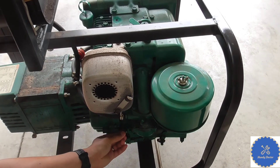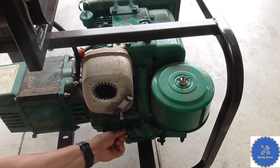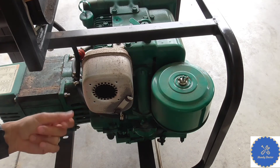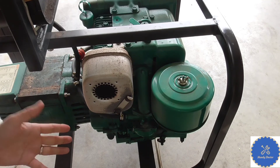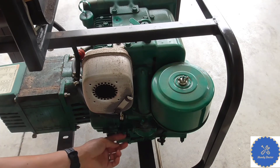So you see the screw out here — you can actually turn it with your finger easily. That will change the number output of the generator, both the voltage and the frequency. Let me pause the video for now and I am going to start the engine, and then we will see how the number changes with the turn of the screw.